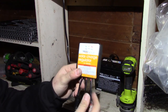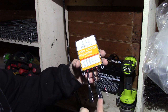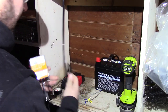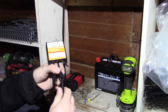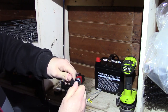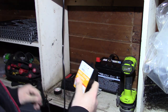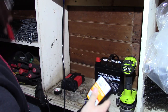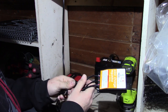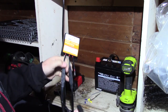This seems very simple. You have the battery that you hook up here, the solar panel which you hook up to this one, and then you hook your load up to this one. So we know the solar panel goes here, so we'll go ahead and hook that up. Now we'll hook the battery up to this side. I'm not going to hook the load up yet.